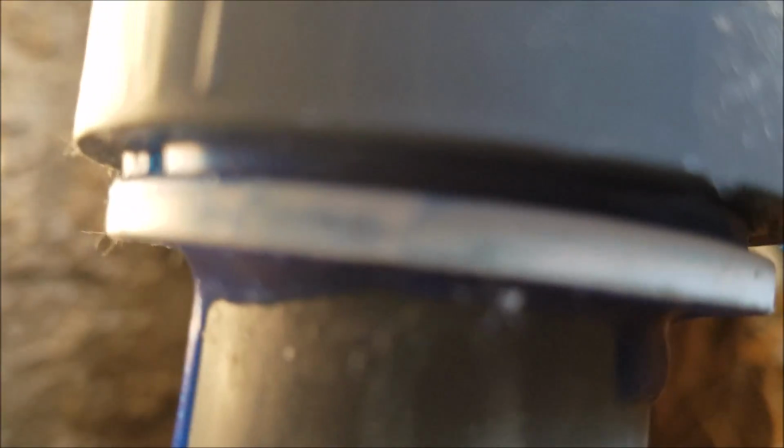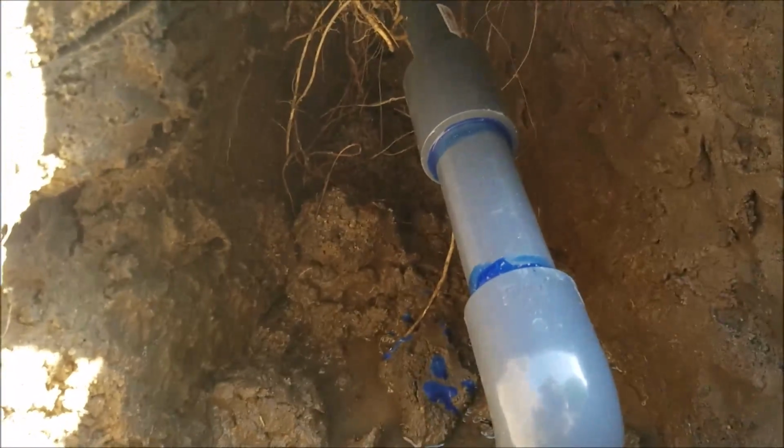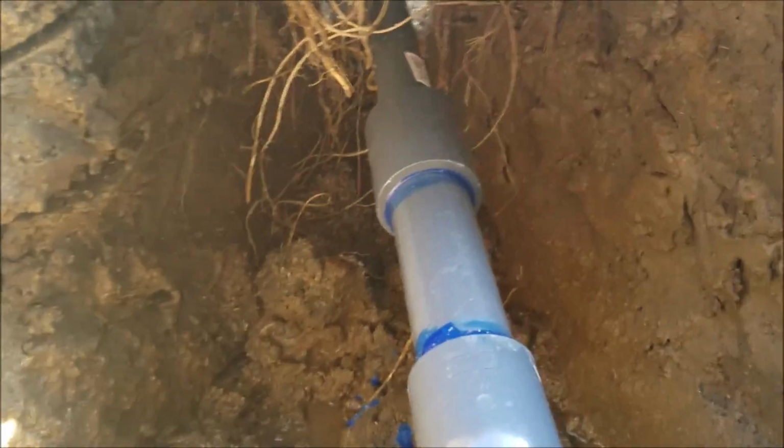And then of course another bushing, and you might be able to see it if it's not too close, maybe not. Little white section. So that's a bushing. And another 1.25 90. So all Schedule 80 in there. The bushings are Schedule 40. We didn't have any in stock, so those are fine, but it's pretty rigid pipe, so this should be pretty durable. Plastic's not going to fail.